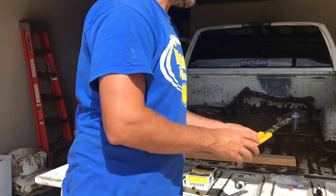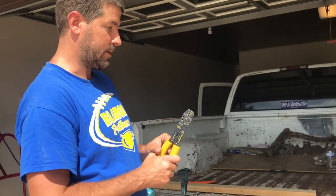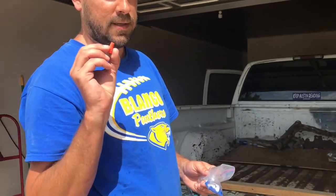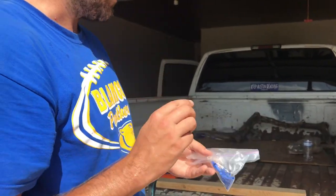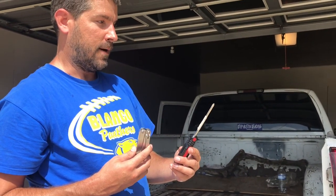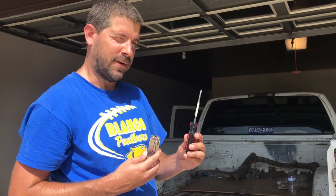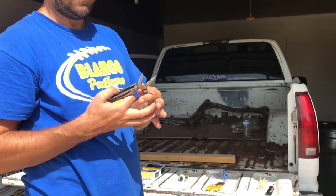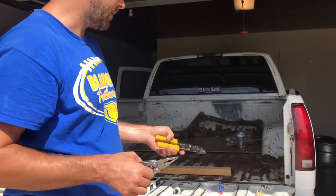For the electrics: a pair of wire cutters makes your life a lot easier for stripping the sheathing — you cut the wire to length and then rejoin it with these wire caps. The orange cap is what I used; blue ones are slightly smaller and red ones are slightly bigger. And obviously a flathead screwdriver for connecting stuff to the solar charge controller — for all the screws on electronics you don't want to use power tools, always tighten them by hand.